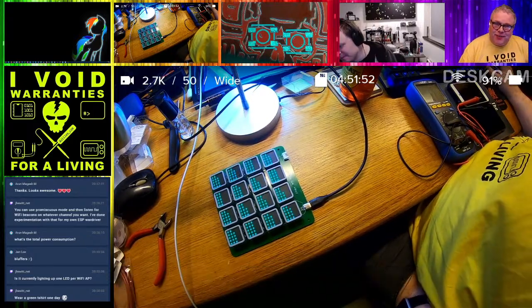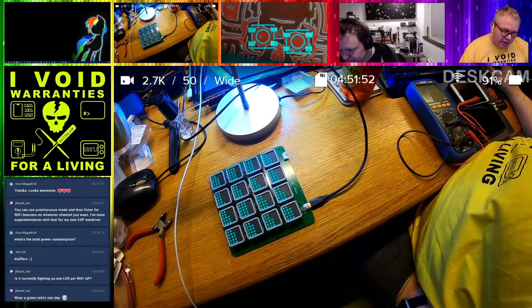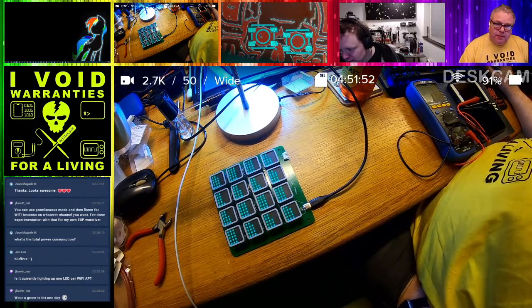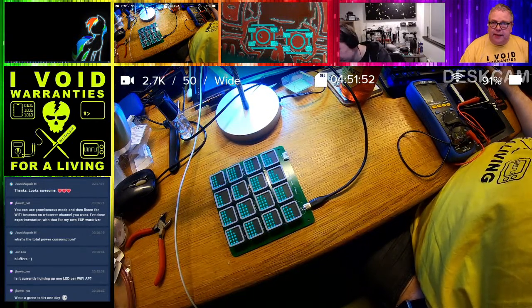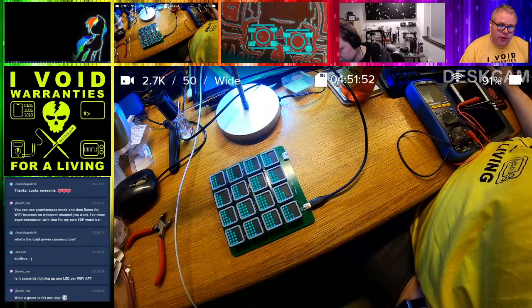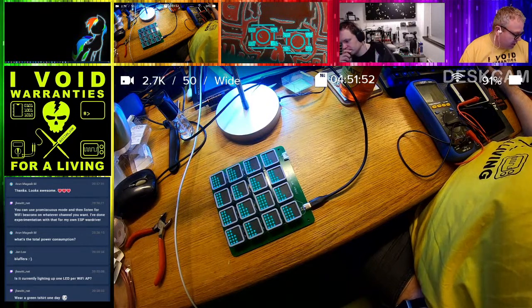And it turned out that you need a NeoPixel bus to have both the NeoPixel working and the CAN bus driver. So if you use that library in Arduino, it will simply work. So I was able to randomize certain bits in the string of NeoPixels, and it would just work.